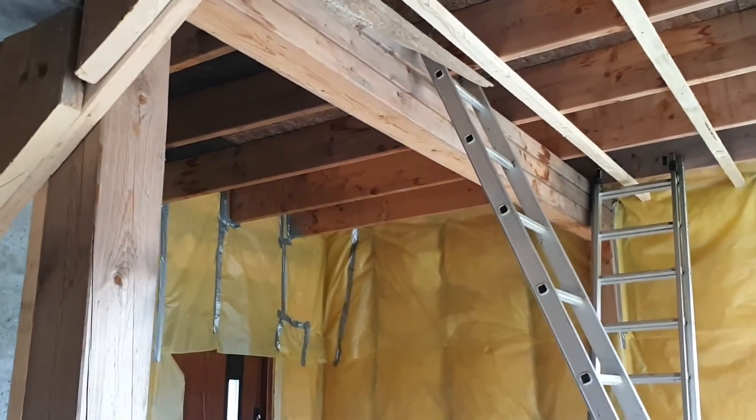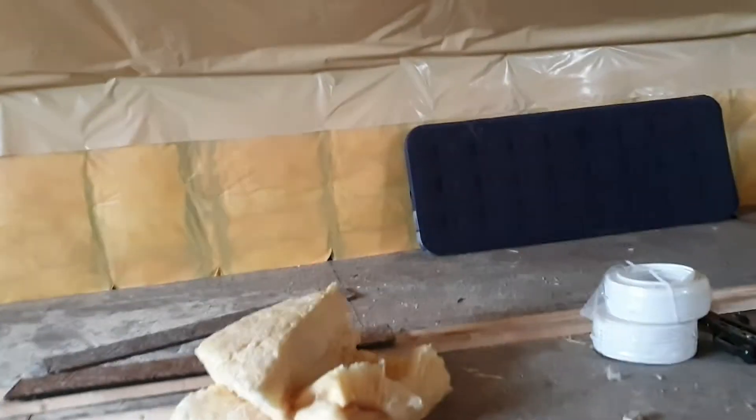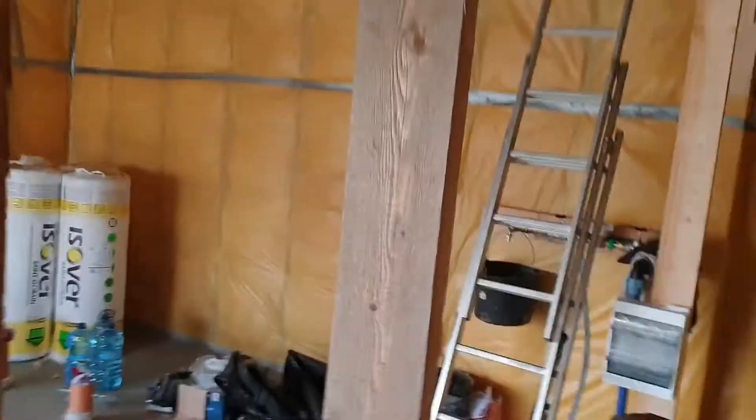And also for the partition walls — the kitchen partition wall here, which will run across with the posts, and the partition walls upstairs. You can hear the acoustic differences here — I don't know if it'll show on the recording, but everything here is already in wool. The wall that separates the bedroom, the wardrobe, and the room with the home cinema and recording room — and there will also be an additional bathroom cut off. So I have to think this through carefully so that I don't run short. If I run short somewhere, I'll just do a suspended ceiling there with metal profiles. Because I can't buy more of these battens — they're made to order in the 5×4 cm size. Maybe I'd get them at a sawmill, but these have dried out nicely and I wouldn't want to lay wet, raw battens because they would warp.